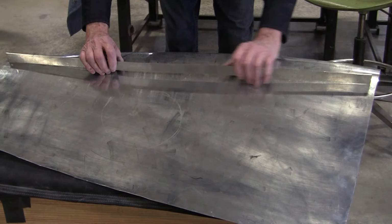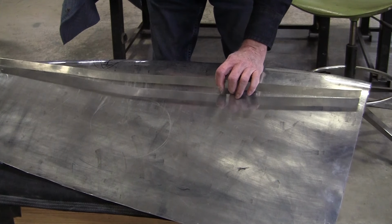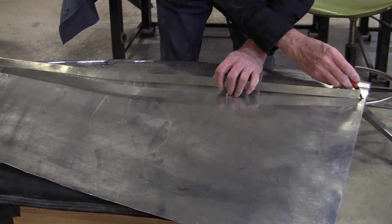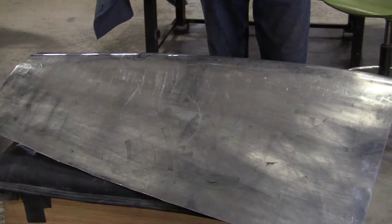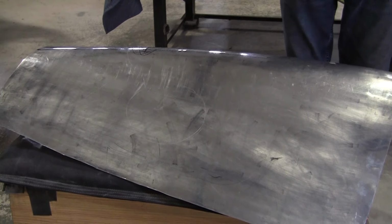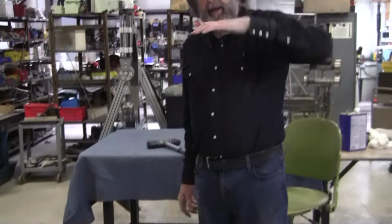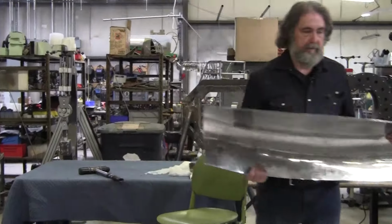And we've got 5⅜ of an inch right there. We can mark that. There's where we're at. And that has to come out. That's all a result of me wheeling the edges to take that overdevelopment out. So basically I seesawed. It was too far one way, and now I'm too far the other way. But it gives you another chance to save the panel.